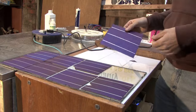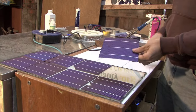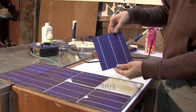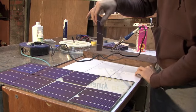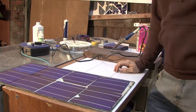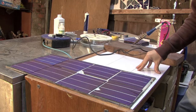Each of these cells, regardless of how big they are — unlike current output, which is proportional to the surface area of each cell — each cell, regardless of size, will give around half a volt output. You can think of it as the current being proportional to the surface area, but the voltage being proportional to the width or depth of each cell. The surface area may differ, but they're the same depth, so they give the same voltage. In order to get up to 18 volts to charge our battery, we put these cells together in a series circuit which sums the voltages, adding half a volt for each cell. That's the series circuit.